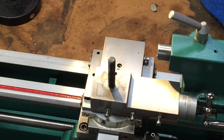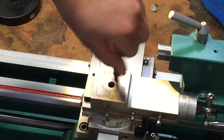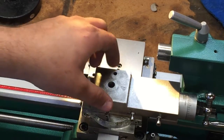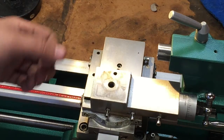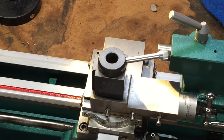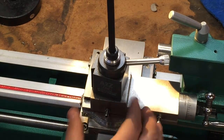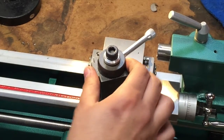Here on the carriage of the lathe, this is a 10mm bolt, and you want to keep this if you are switching away from the four-way tool post that comes with one of these style lathes. This hole usually has a spring and a detent that works as a stop for the four-way tool post — we don't need that. The detent was easy to pull out and the spring I picked out with a small pick. Installation could not be easier. This bolt controls the angle of our tool post.